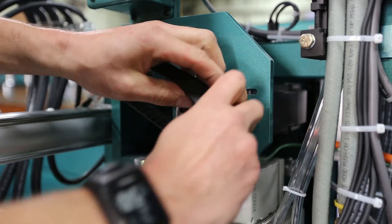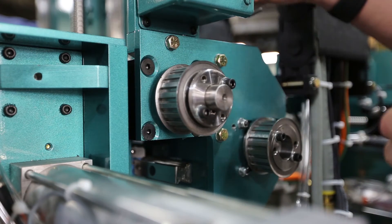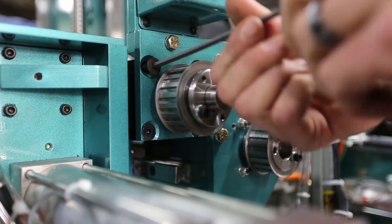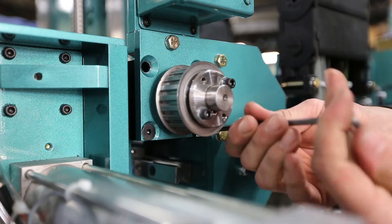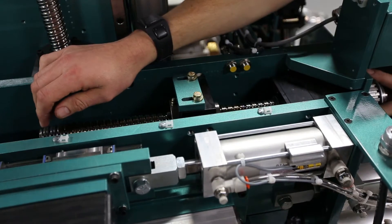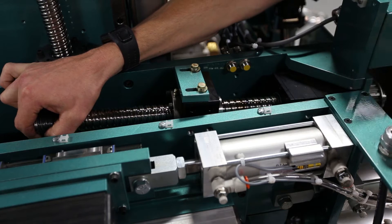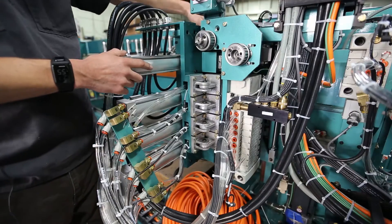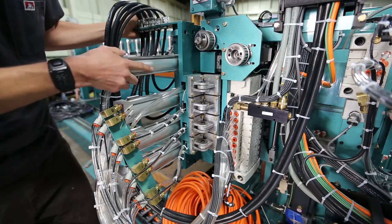Remove the belt. There are 5/32 flatheads — the pulley can stay on. Just take the four bolts out using a 3/16ths Allen, and leave the z-axis screw in the assembly. Once your bolts are out of the front, pick the screw up, lift it out of the machined lip in the bottom of the z-axis plate, then pull back on the head to get it out of the machined box. Once the screw is out of the machine pocket, pull the head back, but watch the first bearing — you don't want to come completely off it. Come back about two-thirds and then stop.